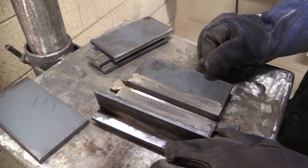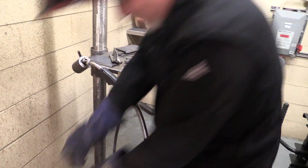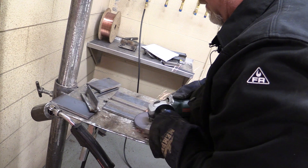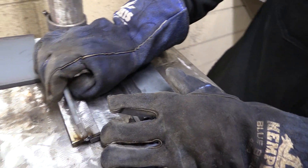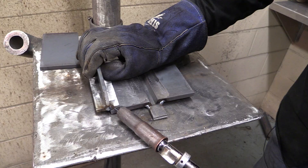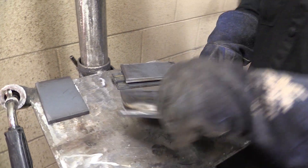Now my T-joint needs to go on here. I haven't removed the mill scale here yet, but we'll do that because it's a good idea to. The cleaner the metal, the better the weld every time. So now I'm going to come in here and overlap this piece because I have to have an overlap on both sides. I'm going to come in and tack it right on the end, and then tack it on the other end. And this ends up being what we call a cluster weld.